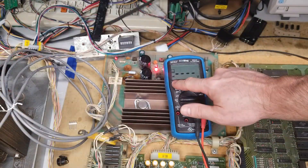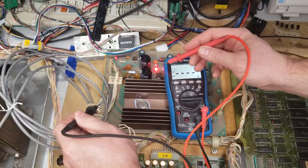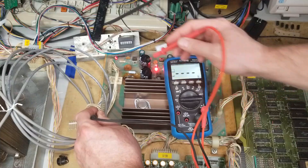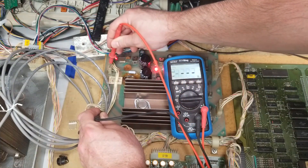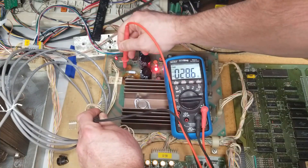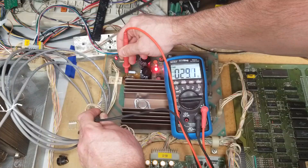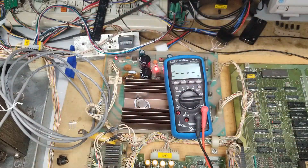The audio board amplifier — there's been comments saying it's only rated for 30 volts. I looked at the spec sheet and it actually says it's rated for 35 volts max, with a minimum of around 10-12 volts. This 27-volt gives you a little bit of headroom, but it is pretty close to the 30-volt maximum. Measuring it now, we're getting about 28-29 volts coming to that Zener right there.